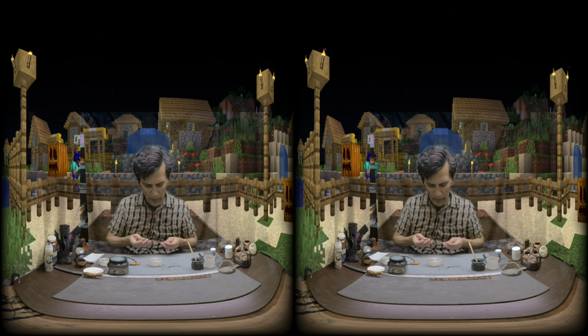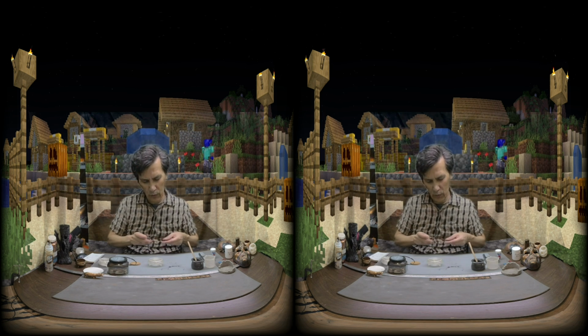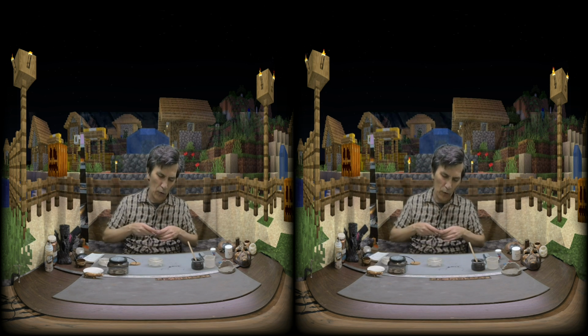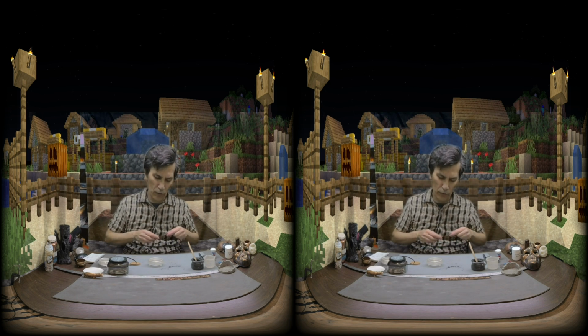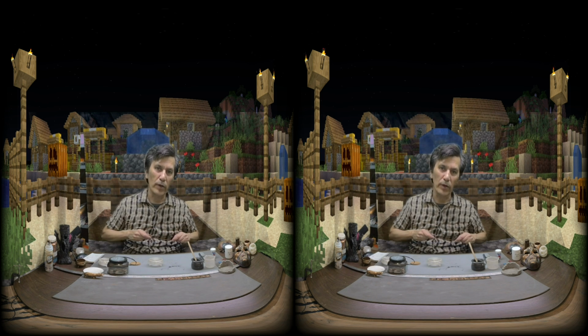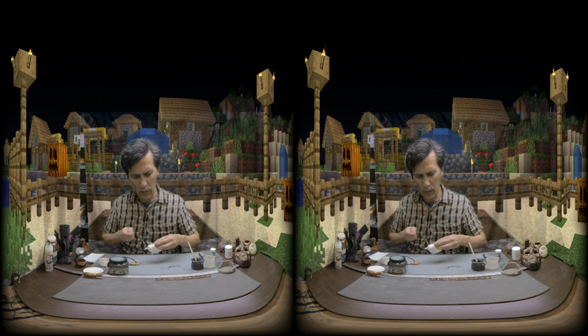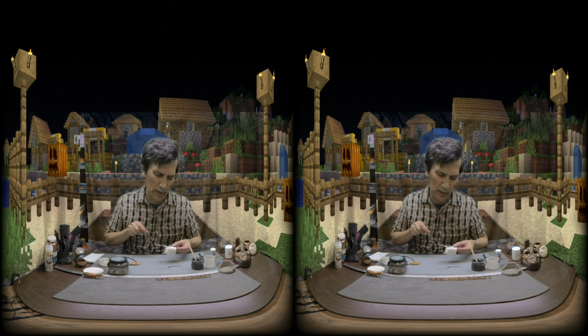Often what will happen if the wire is too thin or the wrong type of power setting goes through it, it will simply break and the part won't plate, and you will have really weird sort of looking stuff.